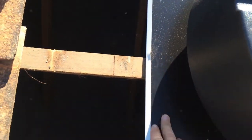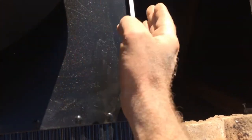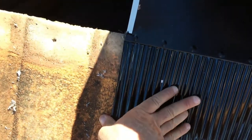Down here we'll put another screw in on either side to hold the vent down. We want to position this so the tile underneath overlaps this flashing on both sides. This one here is going to overlap on the bottom sides — the tongue is actually underneath this, so it'll be back over here. As long as the tile underneath overlaps that on both sides, our flashing just pushes in nice and neat along the tile face on the bottom.